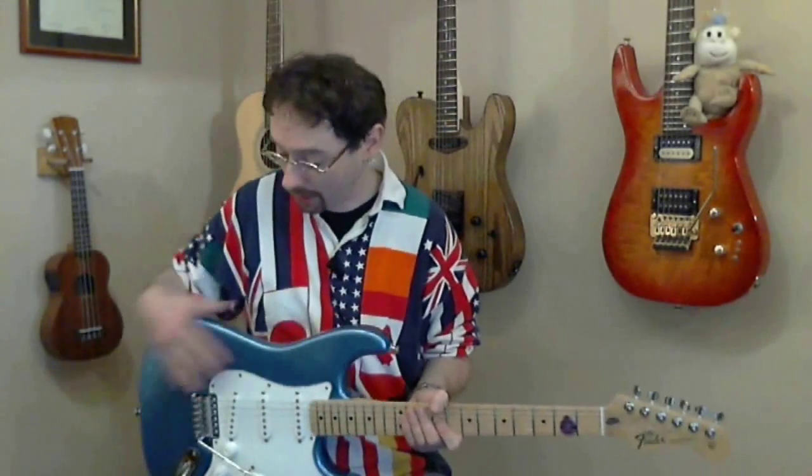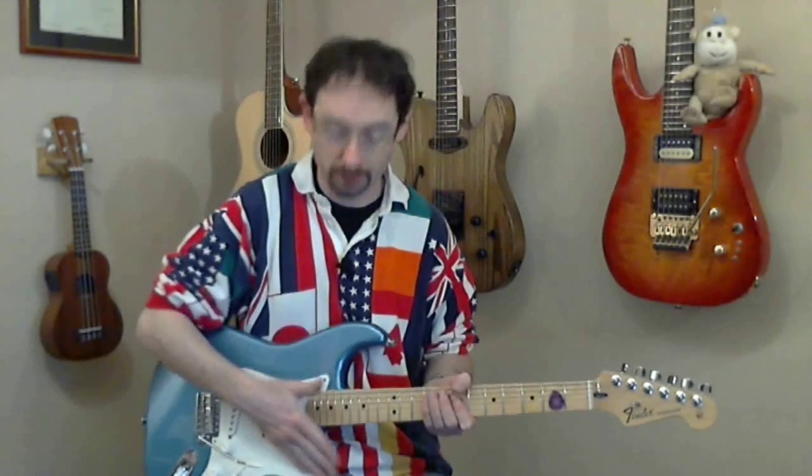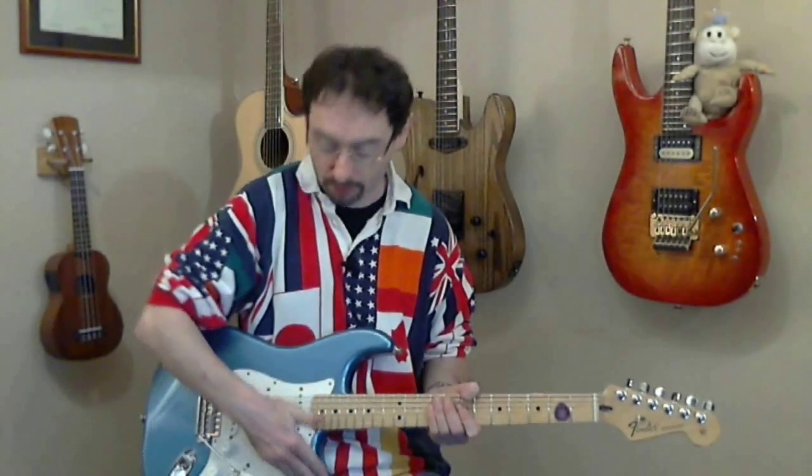Assuming the noise is coming from the guitar, something else you can look at is how well is the guitar screened. Now, inside your guitar, in the control cavities, on the back of the scratch plate, it should have some sort of shielding, typically like a metal foil, or sometimes a special paint that's impregnated with something that gives you electrical shielding properties. It's a little less common, but you will see it in some cases. But yeah, the control cavities and the back of the scratch plate should all be shielded.